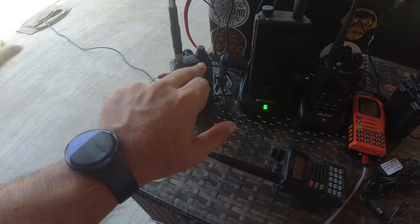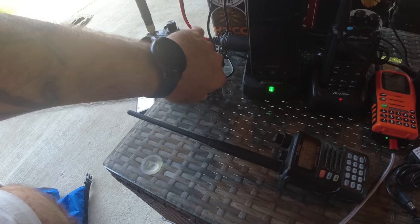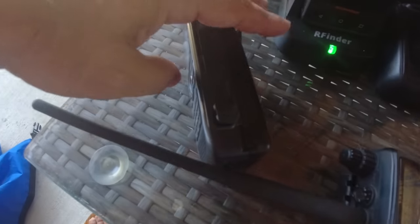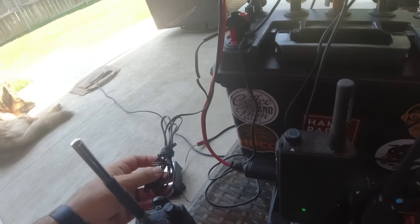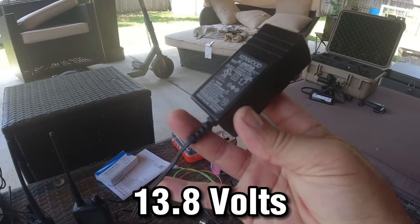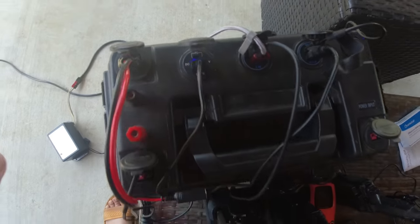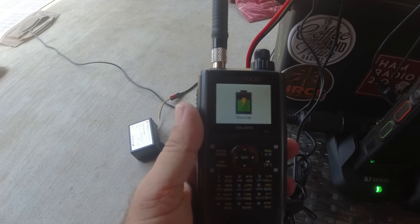This is the Kenwood D74. I'm looking forward to getting the D75 when it comes out because it is USB-C chargeable. This one has a proprietary plug. I put power poles on the end of this cable — if you look at this radio, it clearly says DC 13.8 volts input. I cut the Kenwood charger and put power poles on it. Plugged into the wall, it produces exactly 13.8 volts through the transformer. We've only got 13.1 or 13.2 volts coming in right now, but it's close enough — the voltage doesn't have to be exact, and it is charging. This HT was dead when I plugged it in.